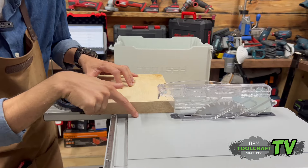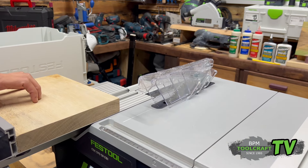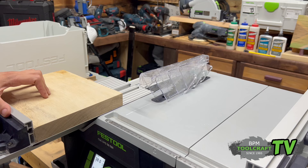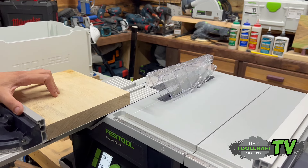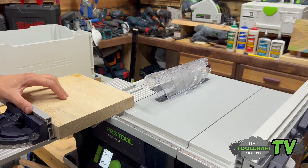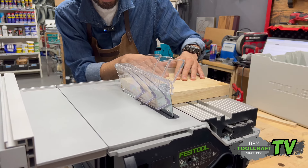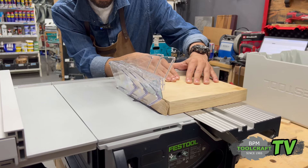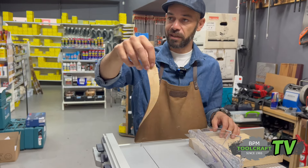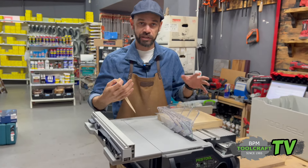This line over here is the center of the blade, so when you're measuring this is your reference line, allowing you to go straight into the blade and have the perfect cut. That cut was too nice. The reason for that quick cut is the quality of the Festool blade, but they also make use of a 1.8 millimeter kerf on this blade, which gives you extremely quick cutting. For a cordless table saw it is extremely powerful — keep in mind it is a cordless table saw, but it is really good.